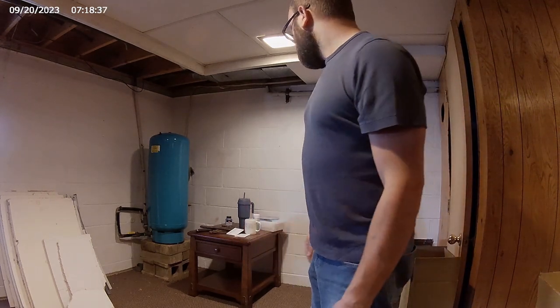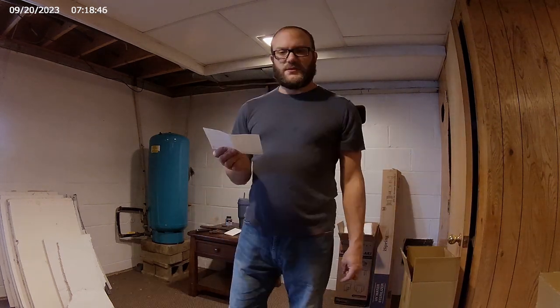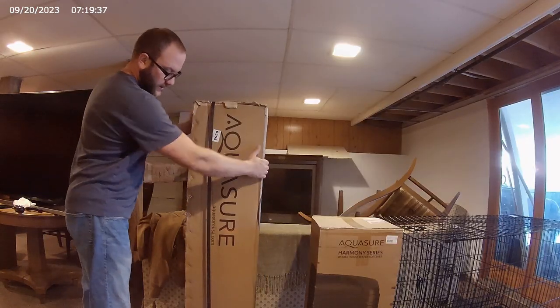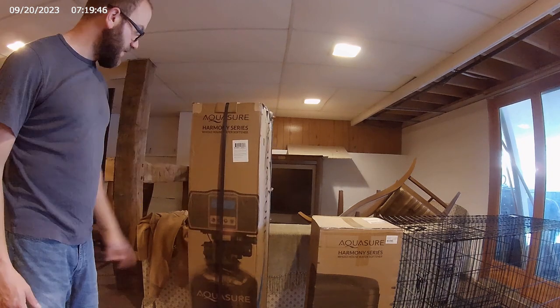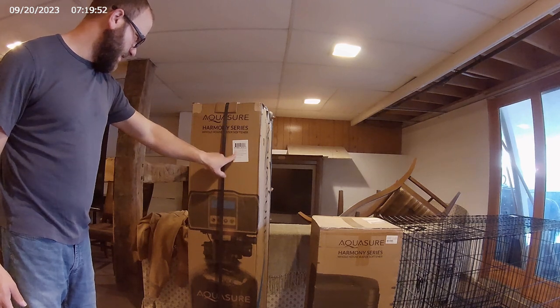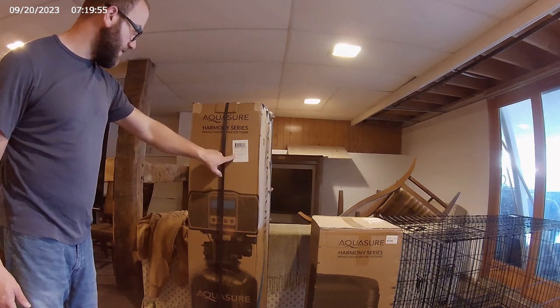And lastly, for the hardness, I found a very helpful YouTube video that I'll link in the description. It helped me calculate how big of a softener system I needed based on my hardness and how many people live in the house. It's 120 pounds. Wait, resin tank. 64,000 grain is what I calculated I needed.